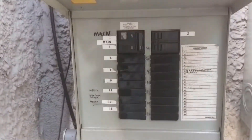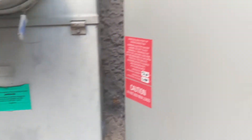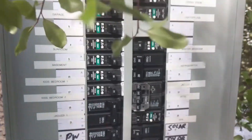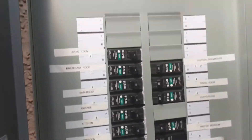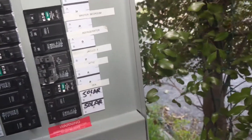With the PG&E box, I have no circuits left in there anymore — just the main, and a second one that feeds this slave solar install. Then we move on to things that wouldn't be backed up: my range is a 50 amp circuit — it's a gas range but still 50 amp. Then this is the gateway, which just needs power and is purely a controller. And here is where the magic happens — all the different circuits. What they did was move all the circuits into here, and this is where all the CT transformers are going to go so I can link this into the automation system and tell per circuit how much power everything is taking.